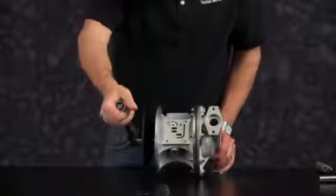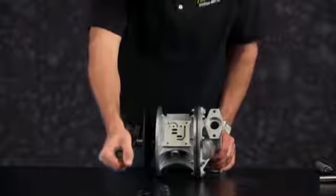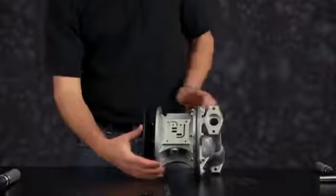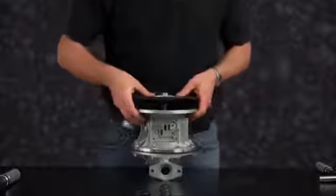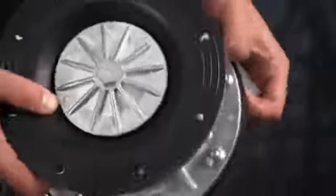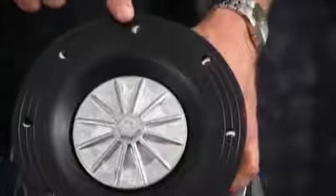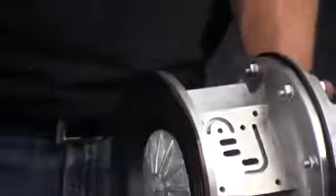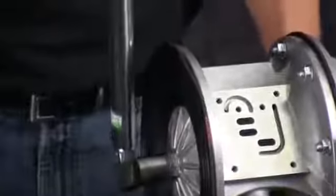Torque the diaphragm assembly. If you achieve torque with the bolt holes on the diaphragm assembly between holes, always go forward to the next hole, never back off. As you can see here, we're not completely lined up with our bolt holes, so we need to go forward to make sure we are lined up with all bolt holes within our center section.